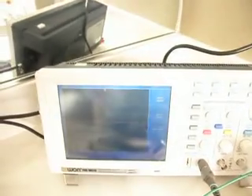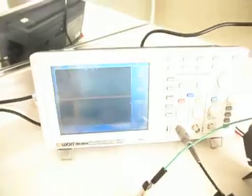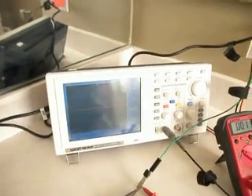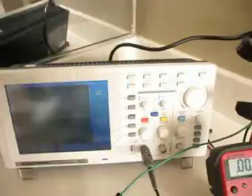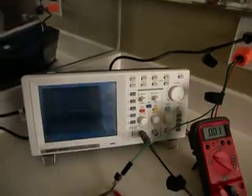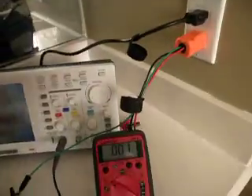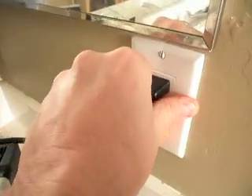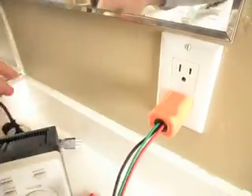And it is for that reason that this oscilloscope actually runs on batteries. When I purchased this, I knew I was going to be doing grounding system and AC system measurements, and I knew that the grounding cable would connect through the main socket and affect my readings. I'm going to show you what it actually reads when it's running on batteries. I'm simply going to disconnect from the wall.